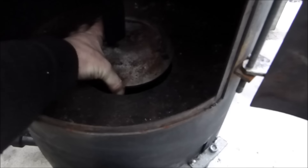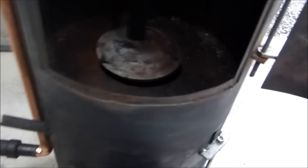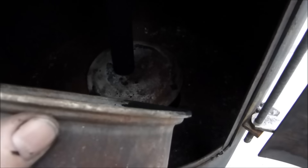So what I'm going to do with this is leave a bit of a gap — it's just a disc. I'm going to leave a bit of a gap so that if I do open the bottom door, it can come up through here and get into the burn chamber. So I'm going to put the pot in — the pot just fits under, it's about two inches from the base of that pipe to the bottom of that burn chamber.